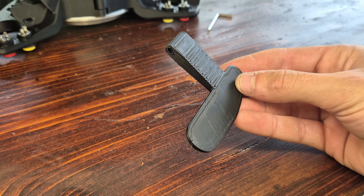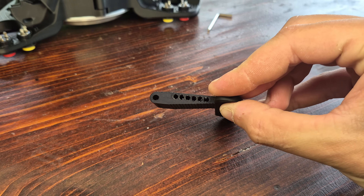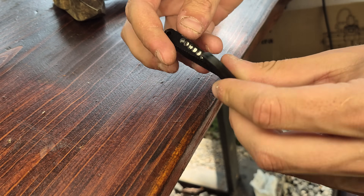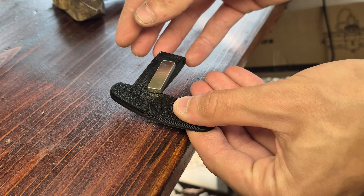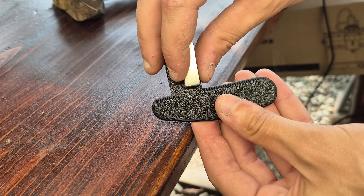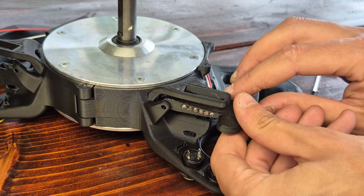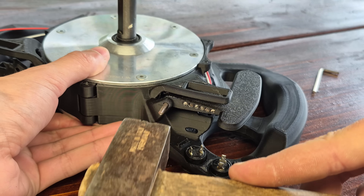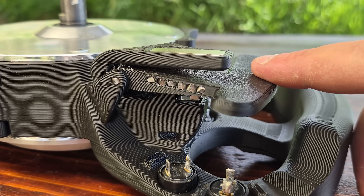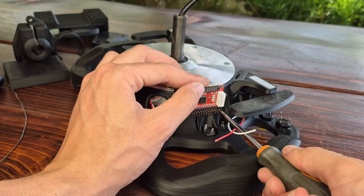Moving on to the paddle, we can see it has a bunch of holes on its side into which lengths of 3 millimeter steel nails can be slotted, providing a metal core that the magnet can track. This also allows fine-tuning the paddle feel by varying the number of nails you insert. The paddle can then be slotted in place using yet another nail as the pivot axle, and the magnet pressed in place. This procedure is then copied to the other side.